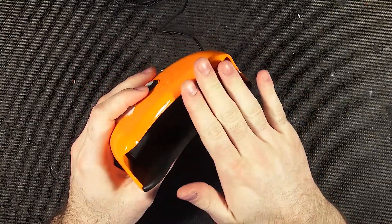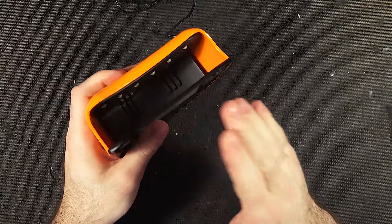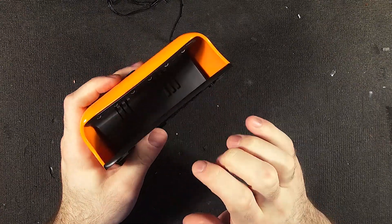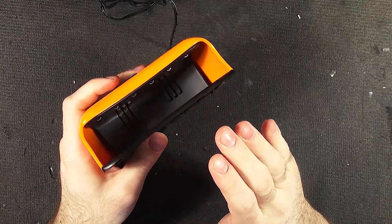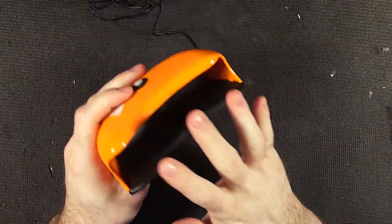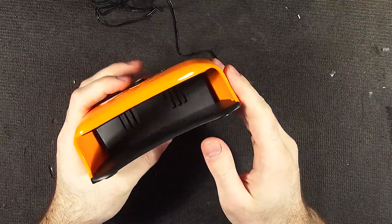But also you can use UV lights like this for hydroponic purposes, such as growing plants, or for curing UV plastics and similar. These might have a slight antibacterial effect, but realistically you need UV-C — a much stronger thing for doing antibacterial stuff. And this does not produce that strong or that specific frequency of UV.